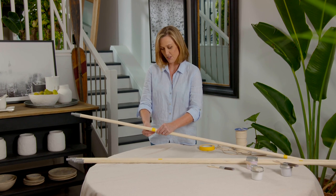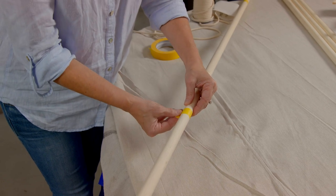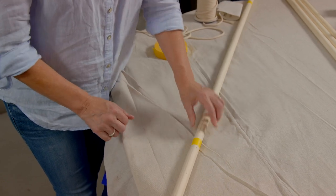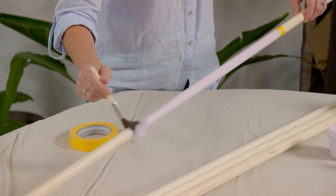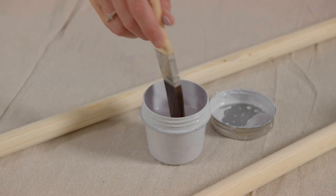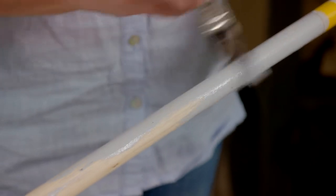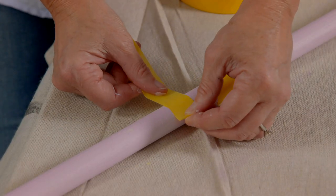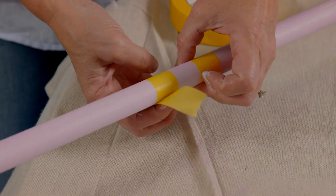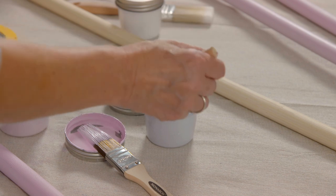This tape — what I'm doing here — is just wrapping it around to give me bands of colour. So in some places you could keep the timber raw and exposed, or you can create stripes of different pastels. Instead of painting the poles just one solid colour, I want to create a striped effect, so the easiest way to do that is with masking tape. If you buy the safe release stuff, it doesn't leave the adhesive on there, and it allows it to be peeled off without peeling off the paint layer underneath. So you can literally put one colour on top of the other, so long as the underlayer is dry.